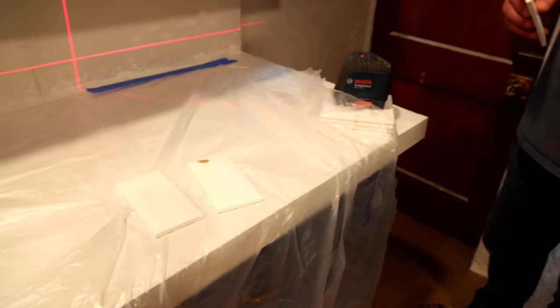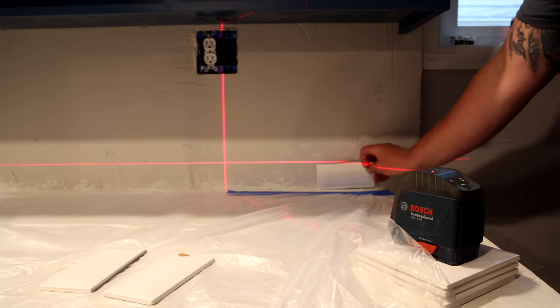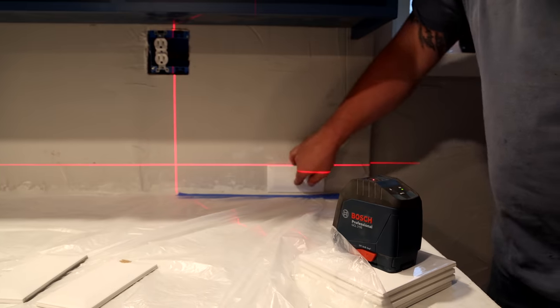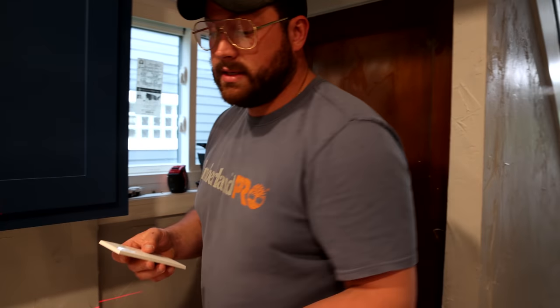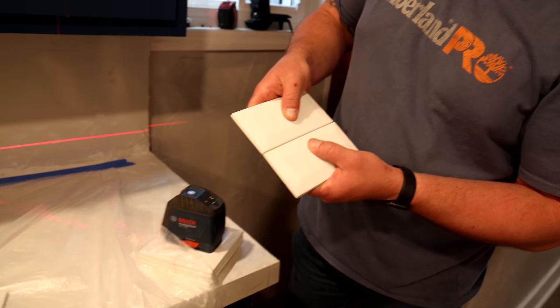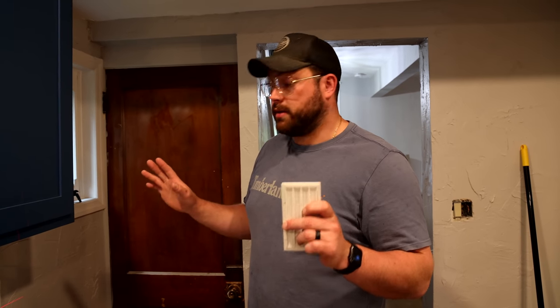We're going with a 6x3 subway tile. A couple things you want to do is make sure you have a straight reference line. We want to make sure we have full tiles at the bottom coming up. You can see that's just barely going to hit the top here, which is fine, because we're going to use this line as our first row's reference. Then if we need to, we'll shave off a bit of the bottom. Also, the way these tiles are built, we don't need any spacers, which should help us keep this moving fast. You want to take measurements before you start cutting your tile because you don't want to end up with tiny slivers. The slivers always look the worst — it always looks like someone DIY'd it or didn't plan. My math's correct; we should end up with a 2-inch piece going into that corner, which should look perfectly fine.